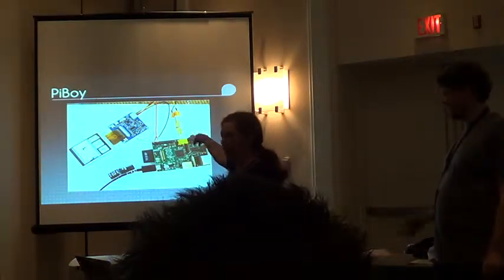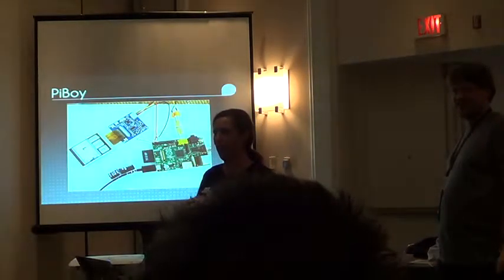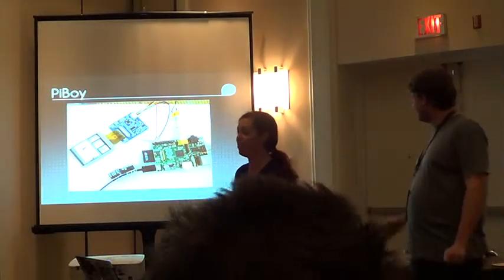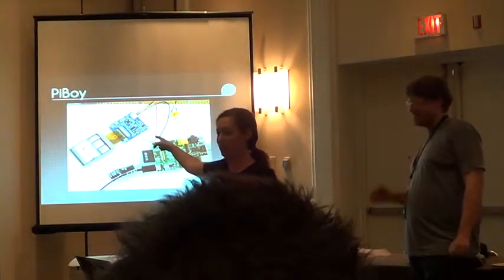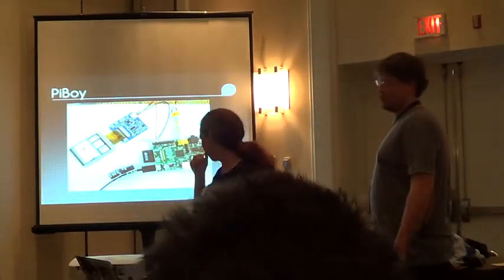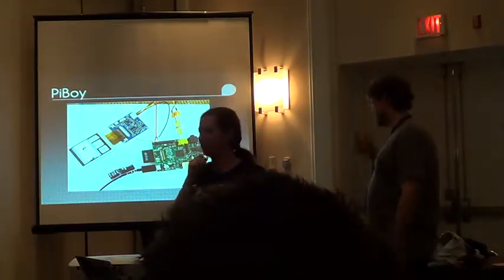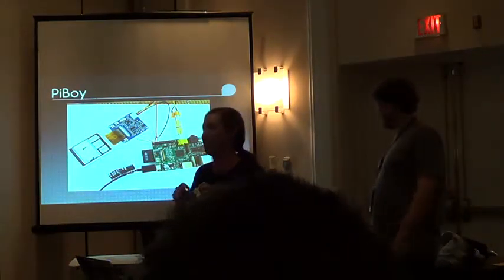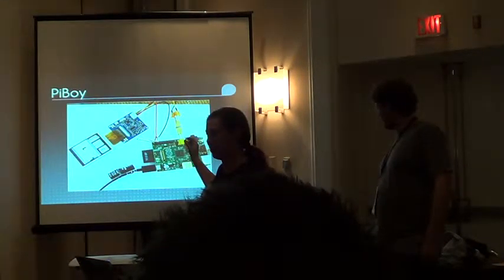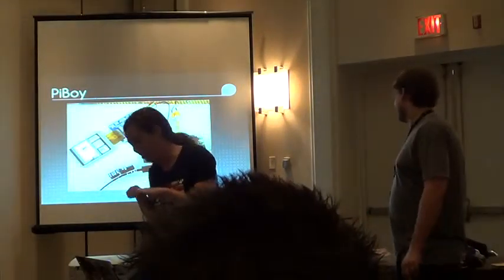We bought this little 2.5-inch TFT screen from Adafruit. It had no instructions, no data sheet, absolutely no information. It was like, here's a screen, good luck with that. Now there's a data sheet. That screen is a 12-volt screen. You may notice it's connected to the 5-volt pin with Amazon elegant alligator clips that are just barely not touching anything else. And so if you really, really want to make this right this very minute and you realize that you have no sorts of devices with which to connect those wires, you get teeny tiny alligator clips, and then you stand over your Pi and make sure that nothing's touching.